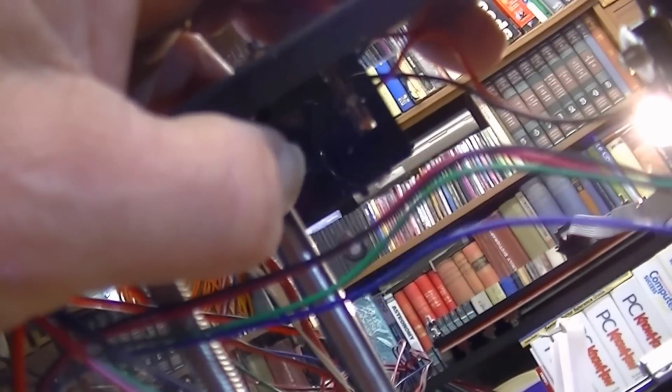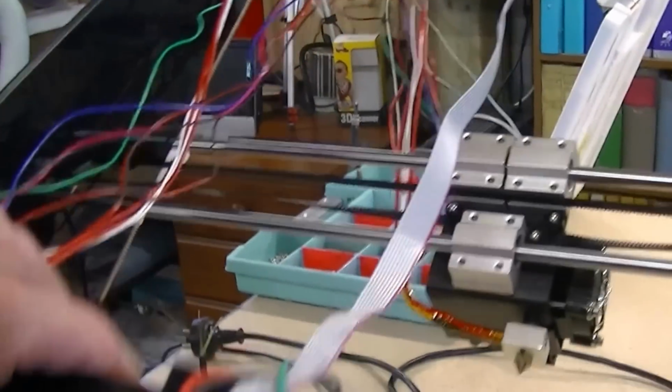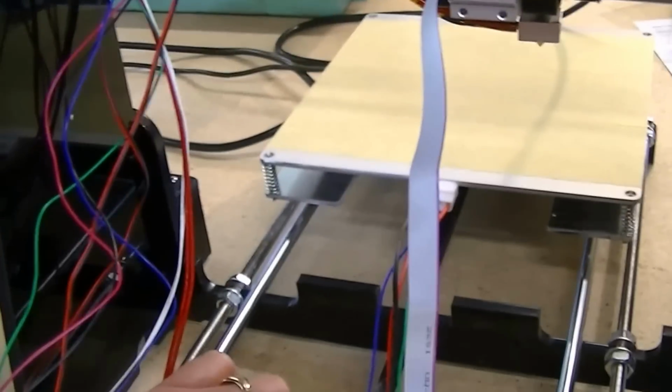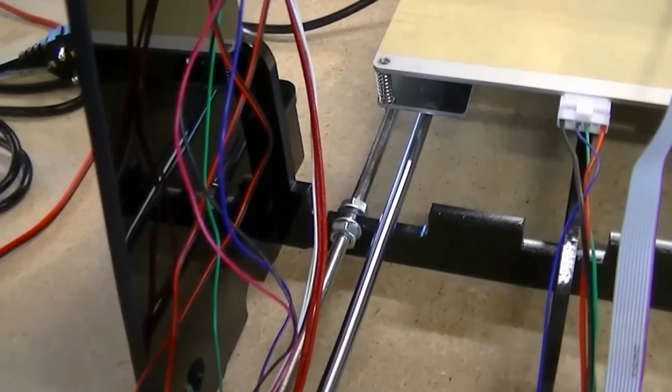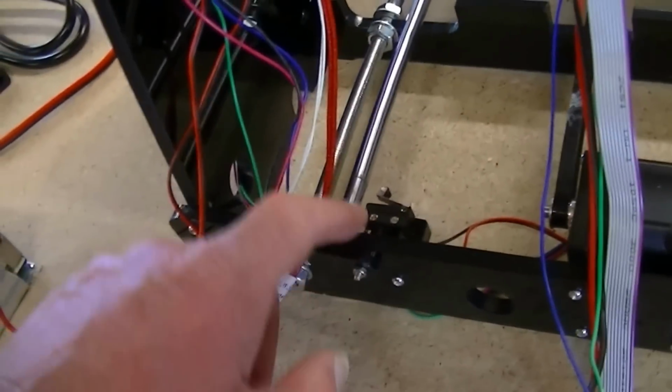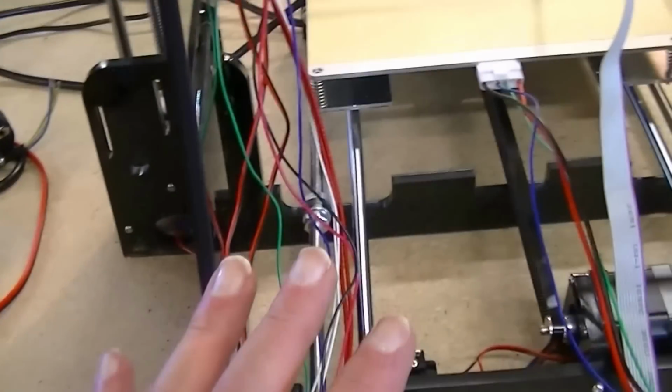Okay, underneath there you'll see these two little metal things? That's the lead poking out the bottom. Well, what I've done is I've just put the lead in there to take up the slack, as it were. In other words, give something for the screw to bite into that isn't going to split the plastic, and it works fine. Just be careful.